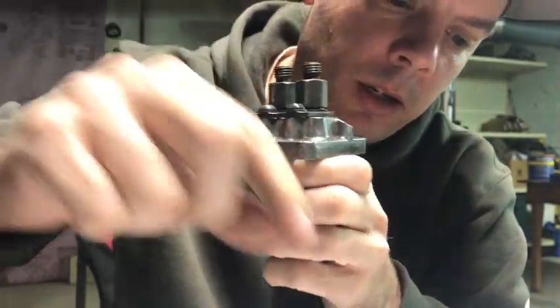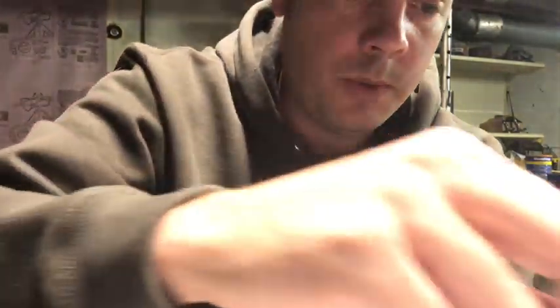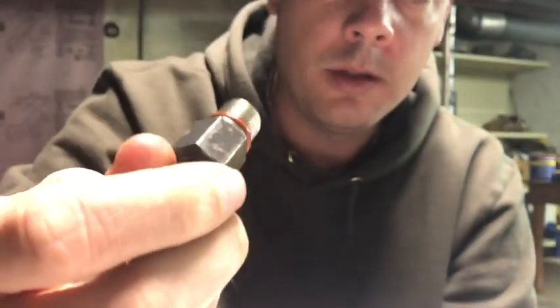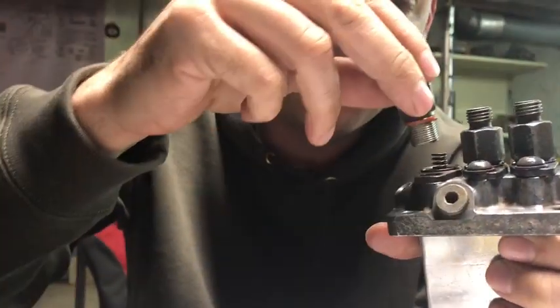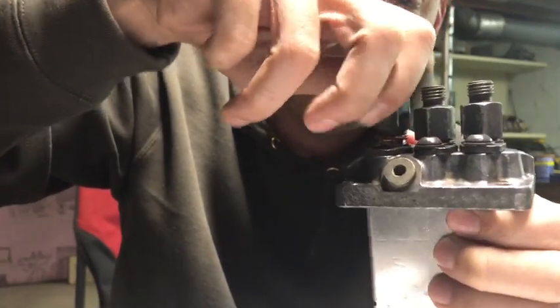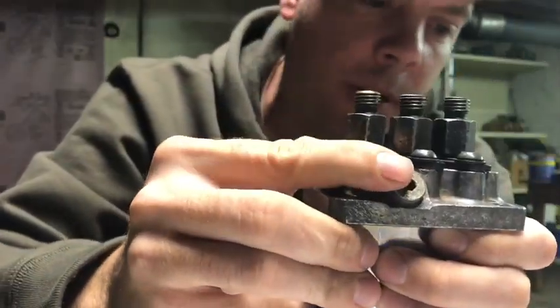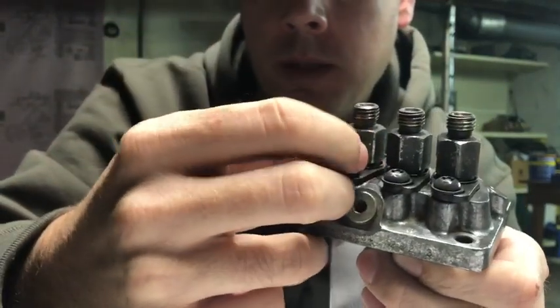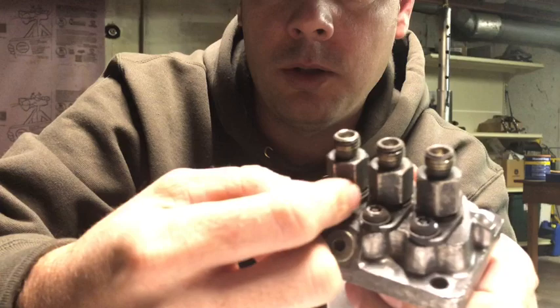For the Zexel pump, the delivery valve just goes down in there — real simple. There is a washer that goes next, and I've been putting just a little bit of oil down in there just to lubricate everything. Then we've got our delivery valve holder with a new O-ring, and we've got our delivery valve spring, which forces the delivery valve back once the fuel delivery is over. It goes into the delivery valve holder. The top part is assembled, so at this point we can take a screw and just throw it in there so that when we start working on the bottom we don't accidentally force the whole barrel holder out of the pump.